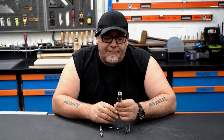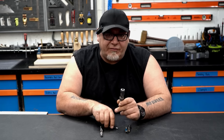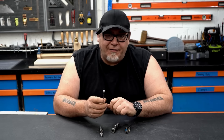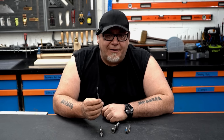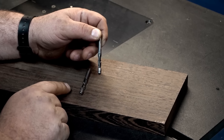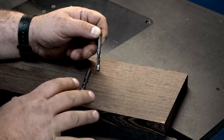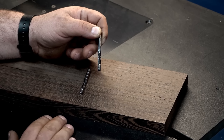There's a place for that combination bit, but most often in our shop you're going to find a quarter inch bit in our router table. Spiral bits come in three ways: they have an up cut, a down cut, or a combination of the two, which is called a compression bit. For our purposes today we're going to focus on up cut and down cut.